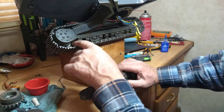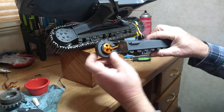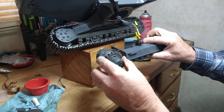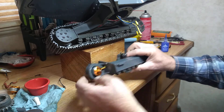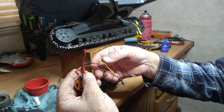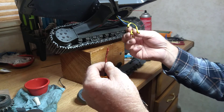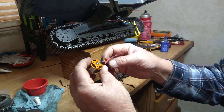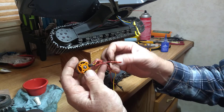We've got a rock down inside here, and the wires are like right up against there. As you can see, the wires are right there. I've got a rock in here, and the sprocket's spinning right here — it turned and severed one of the wires. I tried to solder those wires and could not get solder to adhere to them. I don't know what these wires are made out of, but I was able to get some silver solder to kind of stick. As you can see, one kind of came loose here — it was only held on by two wires. This motor's been acting not right, and I think it was because of the lack of power due to the wire — it only had two strands.